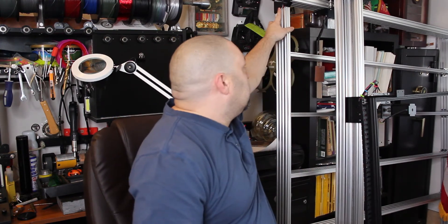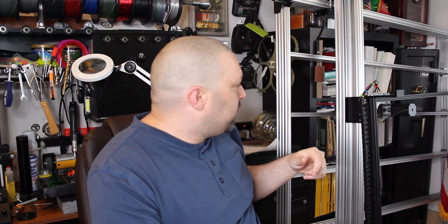With the plates being opposite — all of the plates on this entire machine are reversible, so they can go on the opposite end. Instead of the plate being on the right, it'll fit on the left with the indent facing out, so you'll still be good to go. If you wanted to take your machine apart and change it up like that you can, but it's not completely necessary and it won't damage your system to leave it the way I showed you.